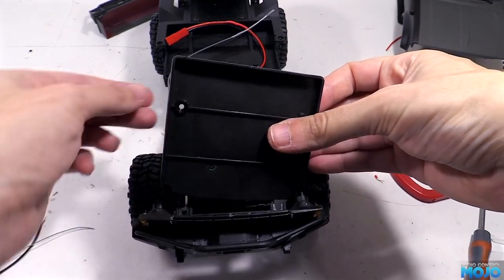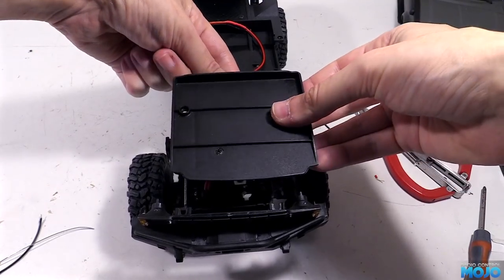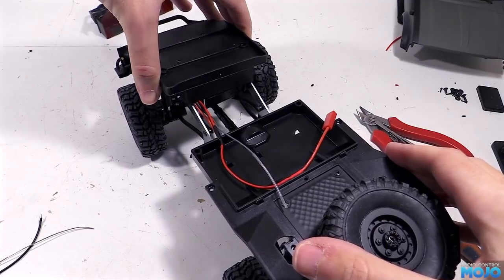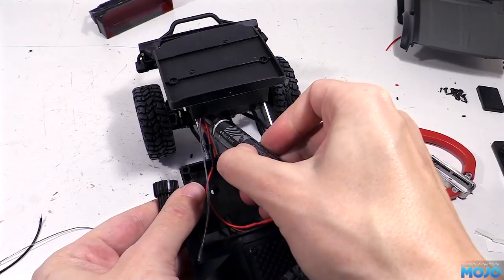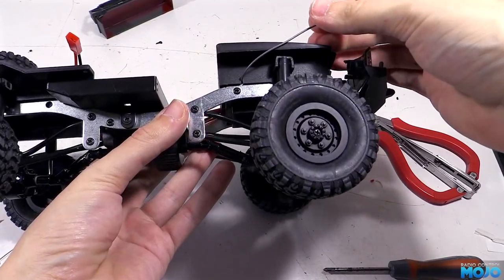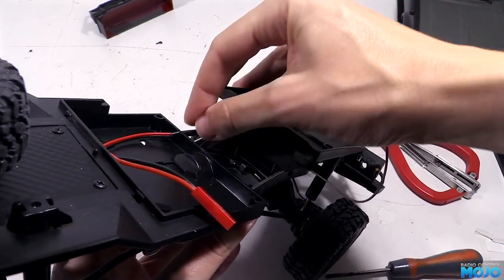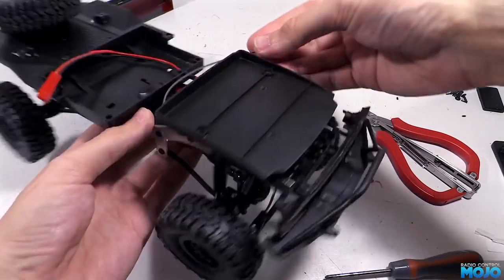Next, the cab mounting plate goes on, but watch out, unlike the B1, this one gets a bit tight and can very easily pinch the wires. Rather than mess about trying to get the wires through a very tight gap, we might as well mark up where the wires come and trim the plastic for clearance. And don't forget the antenna while you're at it. It doesn't take a lot, and once the plate gets screwed down, you can see the wires are sitting nicely and they're not bent up trying to squeeze through the small gaps. The antenna especially doesn't want to see any tight bends.